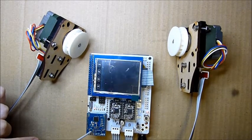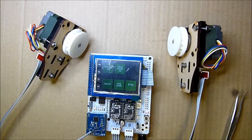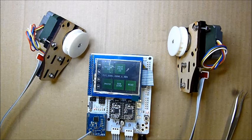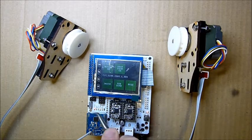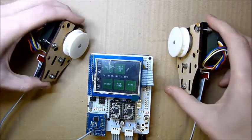It's busy restarting - takes a little while because it's got to read all the card. I've got a message in my software to say the connection has been found. I'm going to send a couple of commands, and you can see them coming in - that's great. I'll do a set home which should move the motors, and a couple of move direct commands. You can see the RX and TX blinking when it gets a new message. These are quite big moves so there's only a couple - but that's really what the testing is that we do.